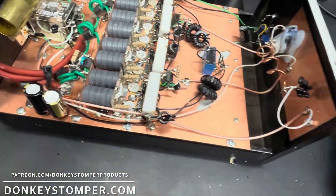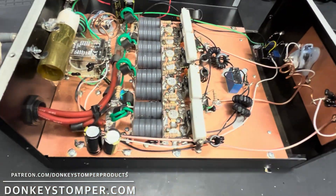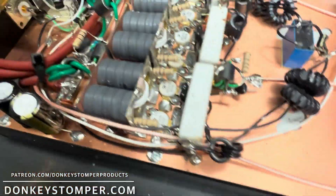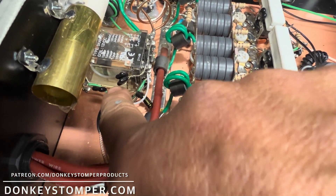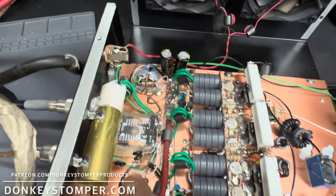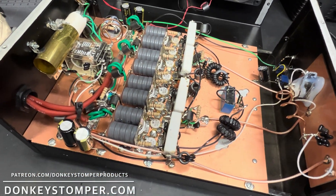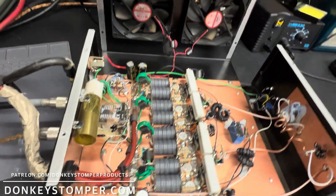The way it was, it had a piece of wire — it'd be just like if you took a six-inch piece of wire and put it on your coax connector on your radio. That wouldn't be cool. Don't know if it came that way or got changed that way, don't care — I fixed it. You can't just leave a piece of wire hanging on a PL connector flopping around in there. That's where the input problem was; the SWR was sky high on the radio. We got that all fixed up.